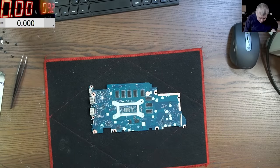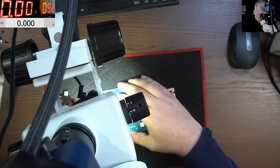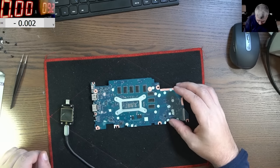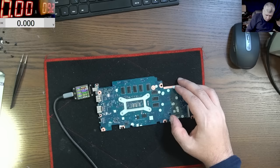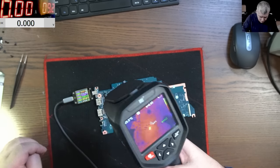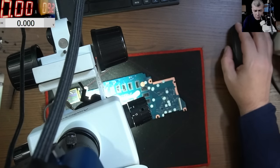Let's plug the charger. Oh, here a chip is missing - maybe it's missing from the factory. Anyway, what can be getting hot is this voltage switcher, and that's actually fine and normal - five volts. That's the one, it's a voltage switcher. That's okay actually. I believe this chip is managing the USB-C power.